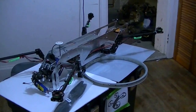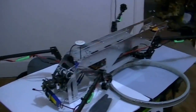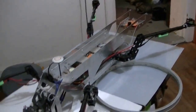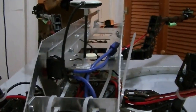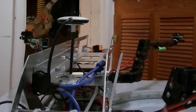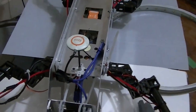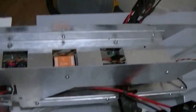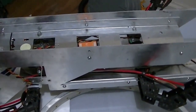Full Spectrum RC here guys. I decided to do a little update on the dragon fire drone. If you've been following closely — she is my baby — you're going to notice she has changed quite a bit. Her stance has changed, as has the electronics layout and a bunch of other things. First off, I did move my GPS, mainly because I wanted to keep it on the brain box I built, but it was looking terrible with the body and wasn't melding the way I wanted. So I took it off and moved it. I also moved all my electronics inside the body — hoping this will save it in a crash, lower the CG a little bit, and help the flight controller work a little better.